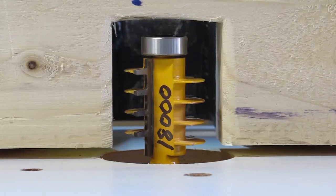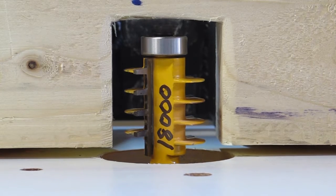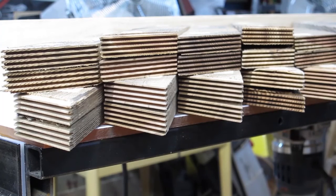You may have noticed that I wrote the different router speeds for my router on the router table that I made. I also write the maximum speed of each router bit on the bit — this way I know the correct RPM for each bit and I can adjust my router accordingly. As you can see, there is no consistency between boards or even the same board. That is why I try to have the front faces of the frames as flush as possible. The thickness of the frames can and often does vary, so the backs are not as flush as the front.